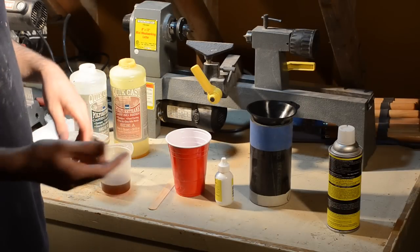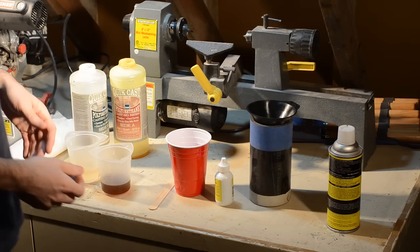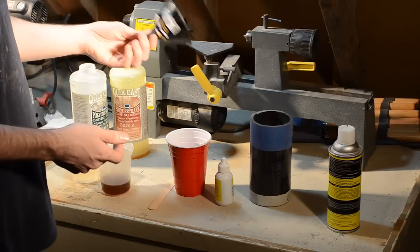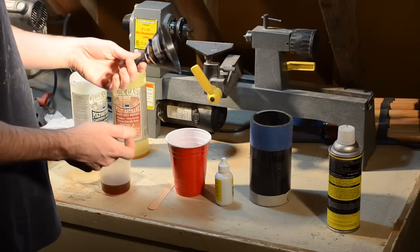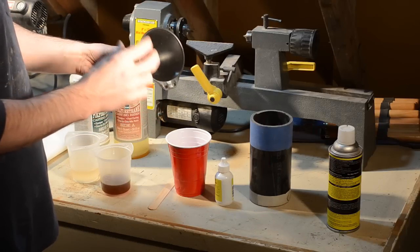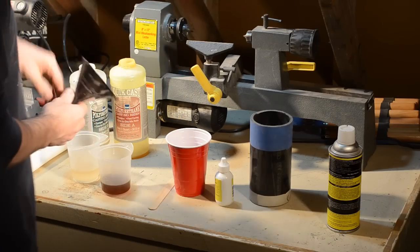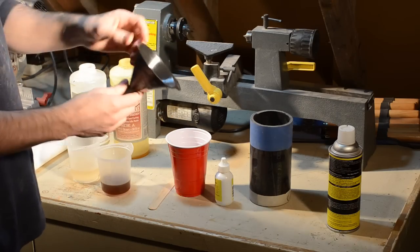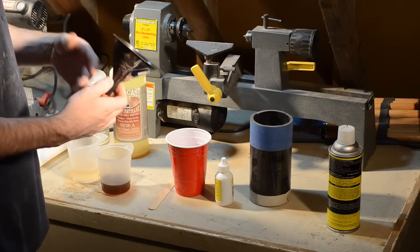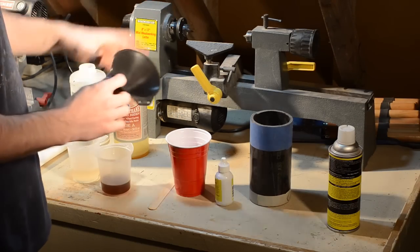The first thing I want to tackle are those spikes. I know I'm going to have to make a bunch of them, so I want to make a mold of them. And because they're cylindrical, I'll use my lathe right here to build the master. Instead of starting from something like a cylinder or a solid block, I found that this funnel is just slightly bigger than the spikes. So I'll fill this with some plastic resin and hopefully I can peel this off afterwards and have a shape that's pretty close to the final shape, then just chuck it in the lathe and get it down to its final form.